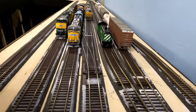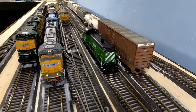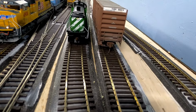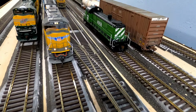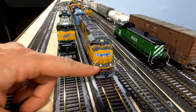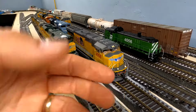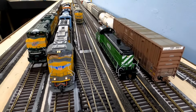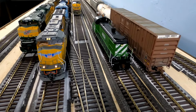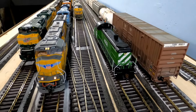One of the drawbacks is that a lot of these companies are using LED lights, but they're using a light pipe still, and they have the light way back here in the back, and then they try and light pipe it up, which looks fine when you're looking head on, but when you move off to the side, the lighting is just too focused. Versus here, these are the older incandescent bulbs on this Athearn engine. And as you can see, they're pretty bright, even from the side, because the bulb was actually up in the housing. So one modification we could make is to take off their LED headlights and wire in some 0402 headlight LEDs right up into the housing, versus any kind of light pipe where they're set back from the housing. But I don't know, that'll be something I do down the road.